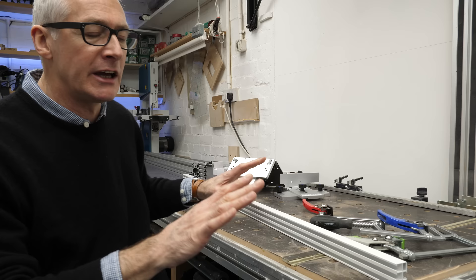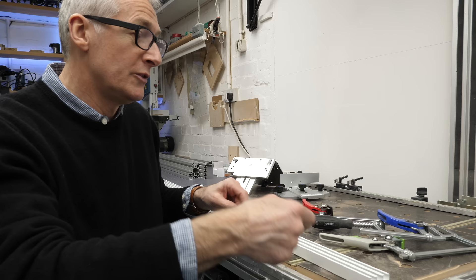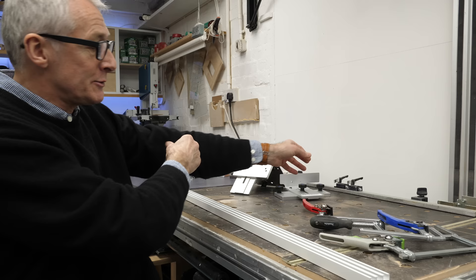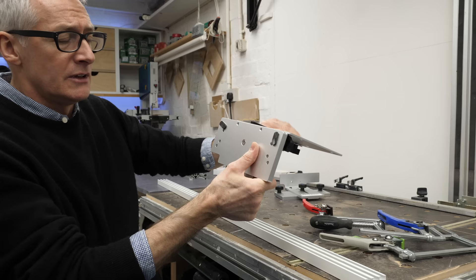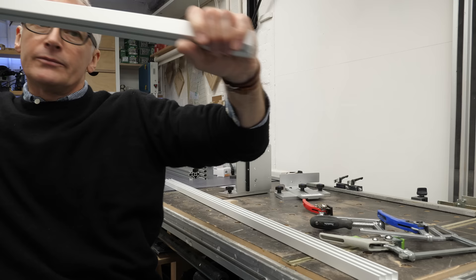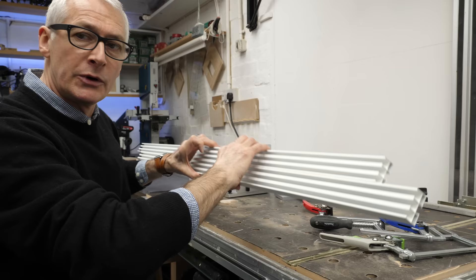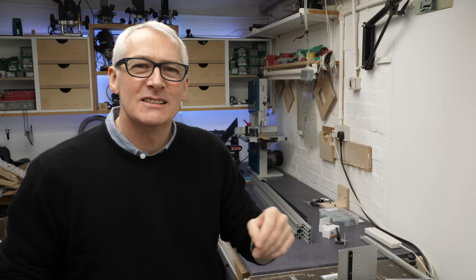I'm not going to use the curtain track as a front rail — I'm just going to use regular T-track, in fact two pieces of T-track. But I'm going to use the curtain track as a rear extrusion because, as I said, it gives me the option to use either the Festool hinge or the Dashboard hinge. One thing Rob did mention is that with the Dashboard hinge there's quite a lot of stress on this as the hinge is raised and lowered, and he thought 45 mil was a little on the thin side. There's nothing to stop you doubling two of those up to provide more support, but I'm going to set it into some 22-mil board above and below to keep it really solid and secure it through the back with the 8-mil T-bolt.